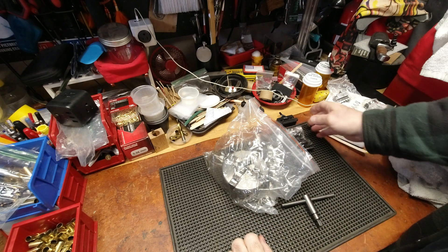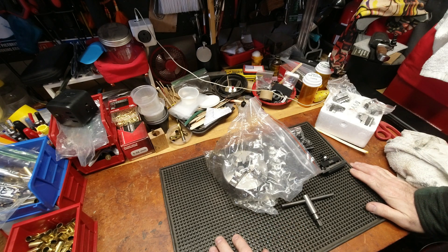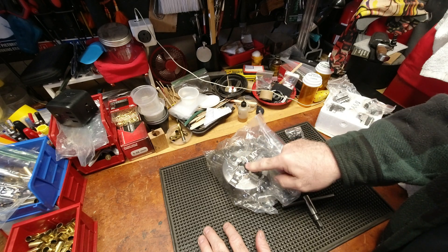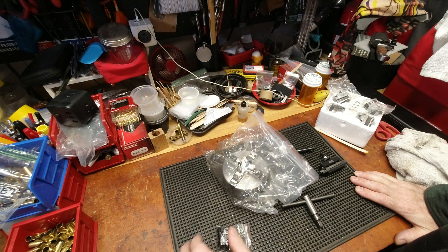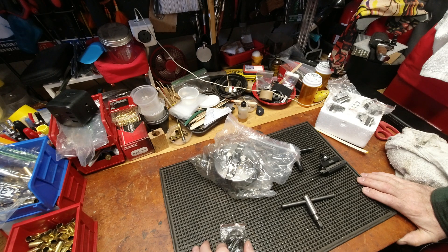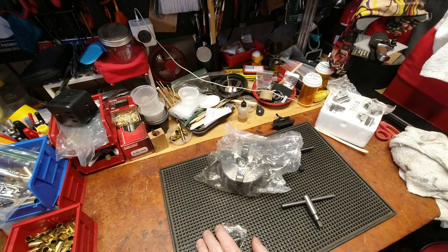I'll add this somewhere to the lathe upgrade videos — the apparently never-ending lathe upgrades and additions series. I just published the first one and already have a series of about three, probably broken into four. I chose this self-centering version over the independent four jaw chuck because all the four-inch independent four jaw chucks seem to have three studs for mounting, which means you'd need an adapter plate. Little Machine Shop sells an adapter plate for about $25, so it's not a showstopper, but I'd be terrified of making my own because of the exacting requirements of something five pounds spinning at that rate.